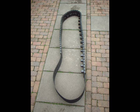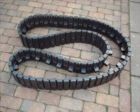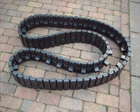This picture shows the track in various stages, starting at the bottom in clockwise direction: the bare belt, then both inside and outside pads glued to the belt, then the pads secured by screws, and the final stage is the guide horns being glued and screwed to every second pad. Using scrounged plastic and drive belt, the total cost of the tracks was around 50 euros or 35 US dollars — that's what the stainless steel screws cost me. Because the tracks are mainly plastic, the weight is down to a minimum. They weigh 8 kilos each.